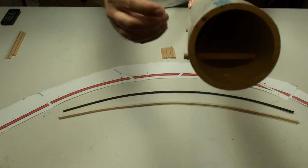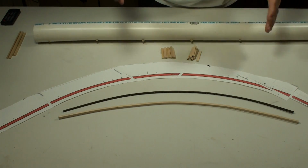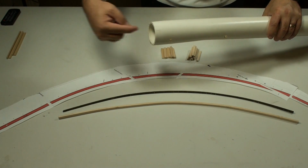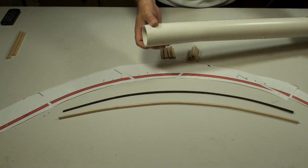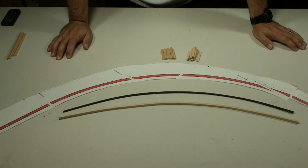I got sticks all the way down for, depending on how long you want to put your wood in there that you need to bend. And steaming it, what I did on the end cap, I have another cap on here which I can't misplace at the moment, but in there was a hole that I could fit the tube for a Wagner steamer into the end of it. And the steamer I used was for steaming off wallpaper. And that worked out just great.